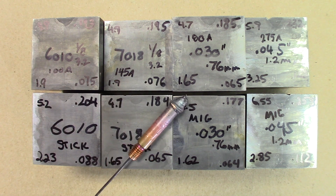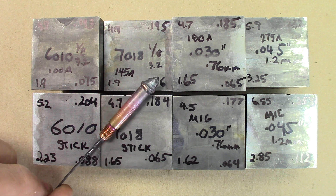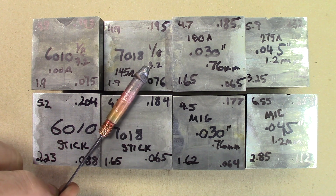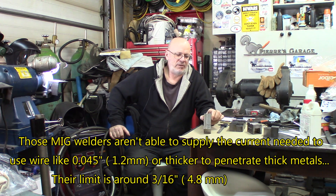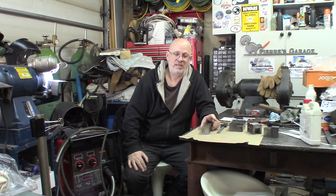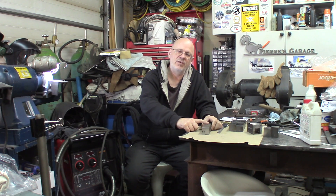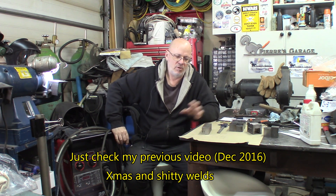There you go — this is what happens when you overdo it on wire. It just melts and doesn't get very far. The plasma arc will get right up and stick right to the tip. So, for people with cheap welders — 110 volt welders, lower grade 220 volt welders, mostly for MIG — if you try to weld solid stock like this, butt weld, no prep, and you make a nice bead, those guys know how to make a bead look nice. And to make it look even nicer, they'll grind the top flat to the stock. What's left to hold is at most a paper-thin penetration weld — holding two things with a paper-thin weld, forget it. It's prone to failure.